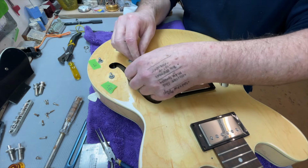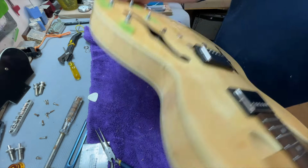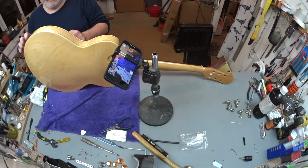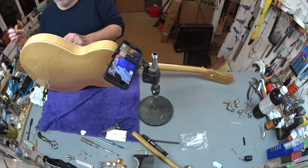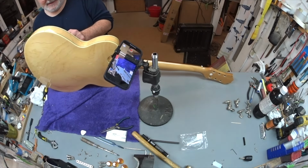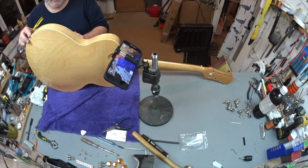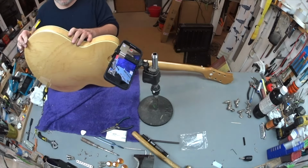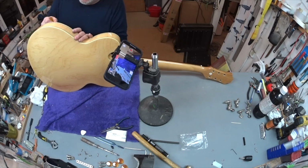Okay, so now we've got those tidied up, and we don't like the sound of that. Pardon me a second. So we're pushing down to get the switch out. We need to get the switch out, but sometimes the switch doesn't come out unless you slacken off the 2 pots sort of attached to it. So first of all, we might take off the little plastic knobble, because that's an extra bit to have to push down. And let's see what we can hoist.